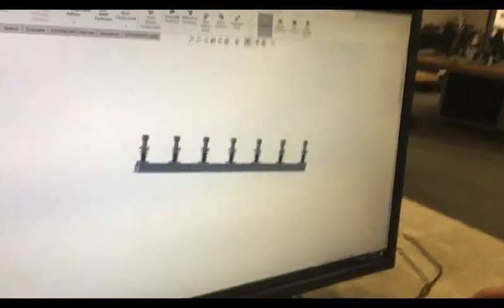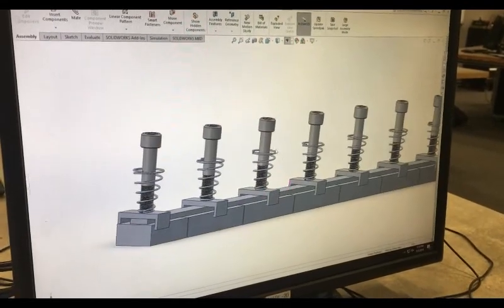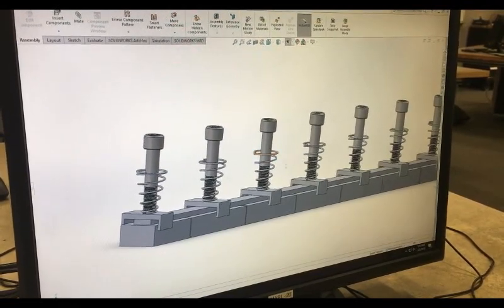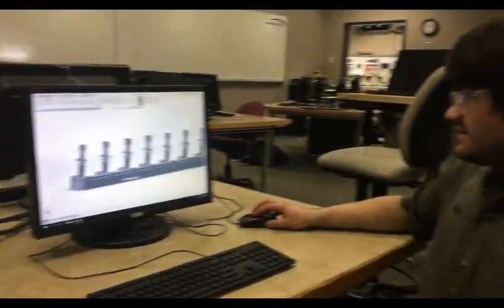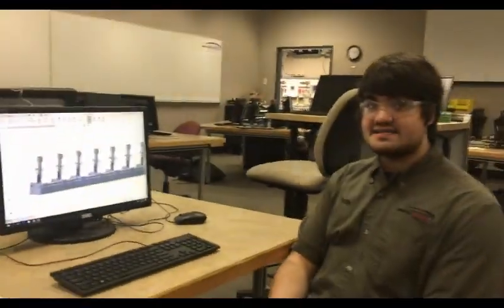Next is our spring assembly. We used some wide end springs to press against the plastic panel on the board. And these are our 3D printed parts, which then bite into the eraser with their teeth. This ensures that it has even pressure along the whiteboard assembly as a whole. And that's pretty much everything with the CAD design.